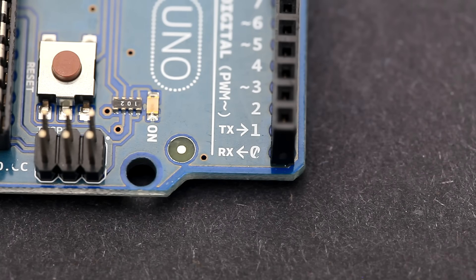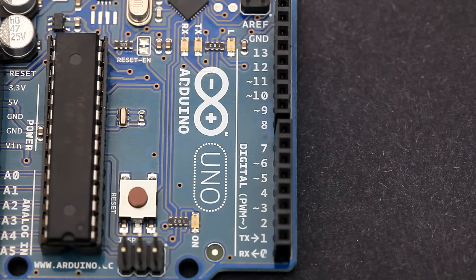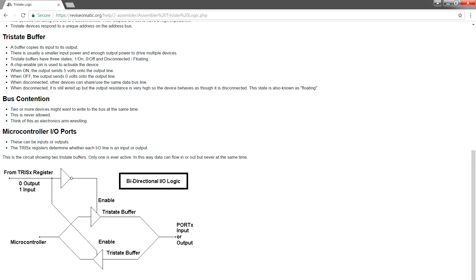TX and RX is for sending and receiving serial data. You could use this port to send and receive data from a GPS module, Bluetooth modules, Wi-Fi modules, and more. Pins 2 to 13 are for digital inputs and outputs. With most microcontroller pins you can actually activate a third state and use them as a digital input. So you can use this pin as an output where it spits out 5V for a digital 1, or 0V for a digital 0, or you can internally configure the Arduino to expect a voltage on the pin, and that voltage could be interpreted as a 1 or a 0. It's a system called Tri-State Logic, and Arduino makes it really easy to change between inputs and outputs in software.